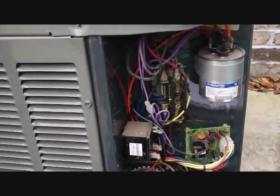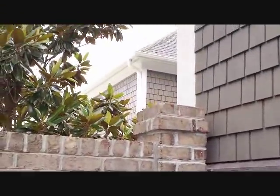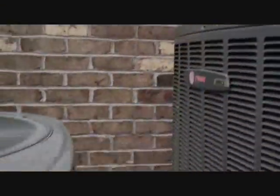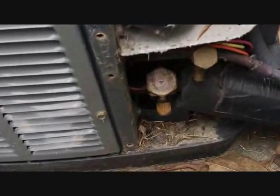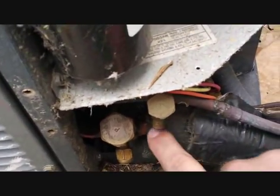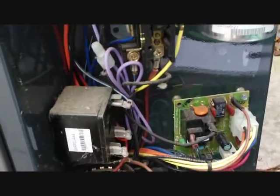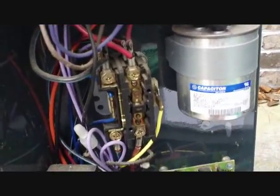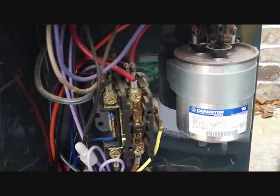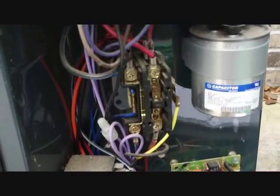Now we're on the other side of the house — it's a big house, there are four systems. We're checking out a tenant house system that goes over the garage. One thing I've already noticed is there looks to be a little bit of oil right here. It could just be from someone working on it, but there's a decent amount. You can also hear the TXV ticking — during operation it was ticking loudly. Sometimes you can have non-condensibles in the refrigeration system causing the TXV to tick like that. We'll see if that liquid pressure is running high.